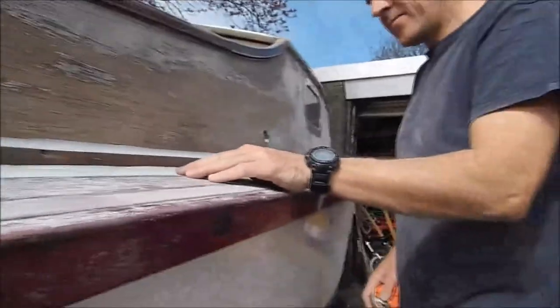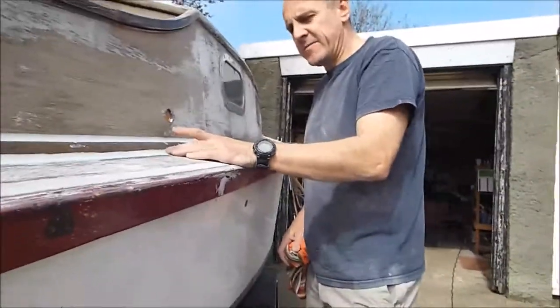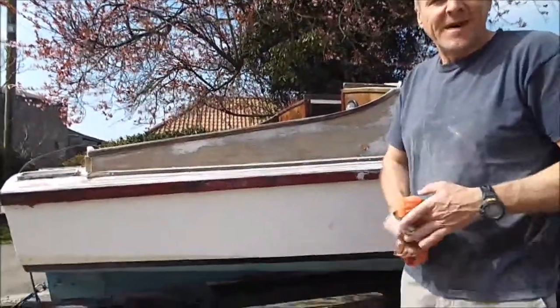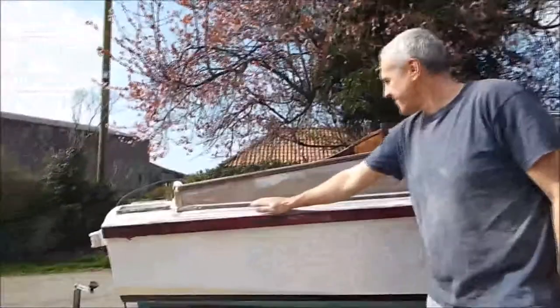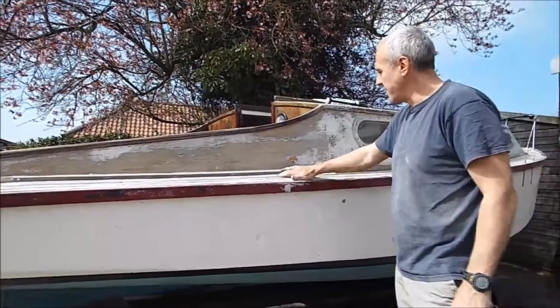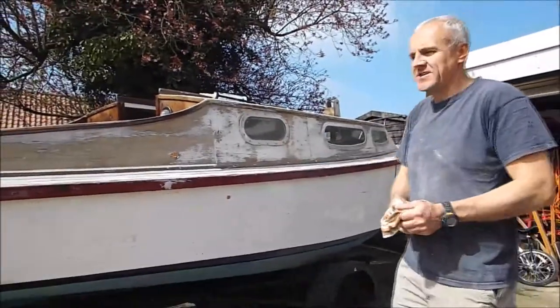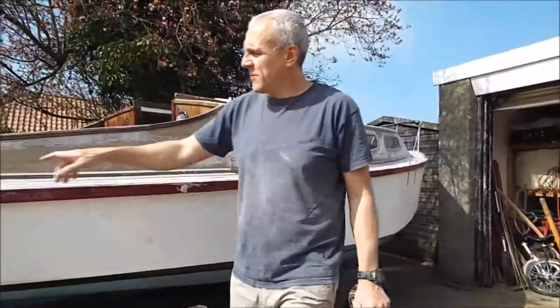Smoothing that top bit out a little bit, trying to make a nice neat joint. If we just stand back now and look at that - you can see that's quite smooth and quite nice. That will take a coat of paint quite happily, be dry in an hour or so. I'm going to do that all the way around the outside, across the tops and down the sides. I'm going to do the bits at the back around the boxes as well, just to stop the water coming in.